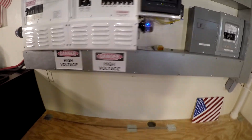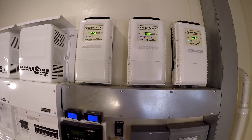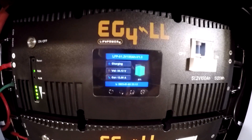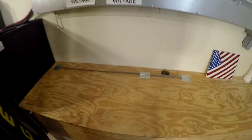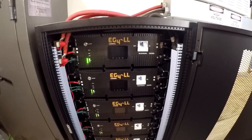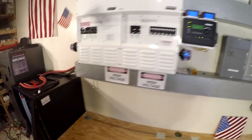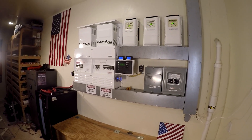We'll have to check how performance goes as we use it. But it's noon — we've got about 6 or 7,000 watts coming in, 82 amps going into the battery bank, and we're 82% charged. That's great. Normally around this time of day, the lead acid bank would already be topped off, so we'd be wasting power. But now with this lithium system, we'll probably put another 10 kilowatt hours or so in here, and then we can use that power tonight. We'll see how performance goes — that's it for this one. Thanks for watching, I'll see you on the next one.